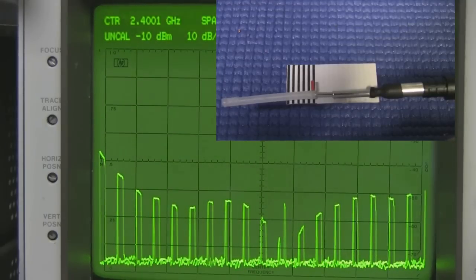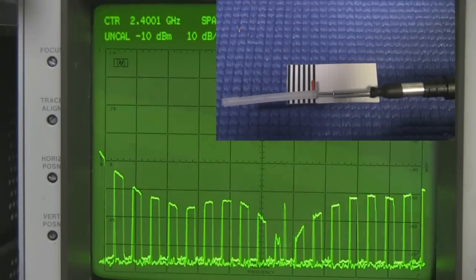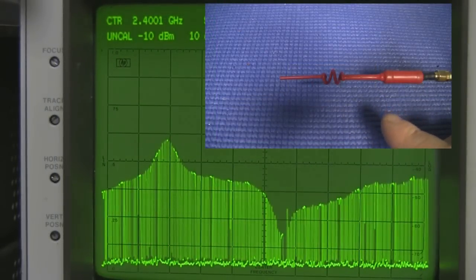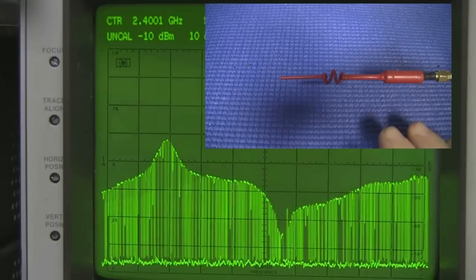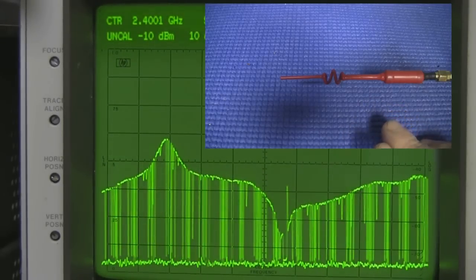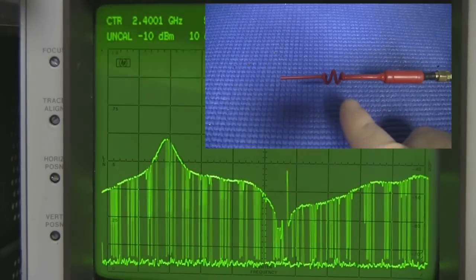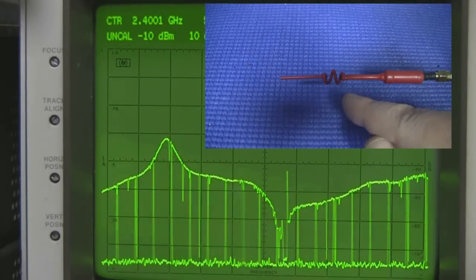That's a really good example of the small measurements needed to get a great antenna versus an okay one — with the driven element at 31 millimeters, as I've just shown, it wouldn't work at all. These experiments with the adjustable dipole helped me come up with a new dipole I'll be releasing next week. The measurements I settled on, especially the end driven element which is rather short compared to what's traditionally used, and the loading coil which has fewer turns but is quite wide — I wouldn't have used those without doing these experiments.